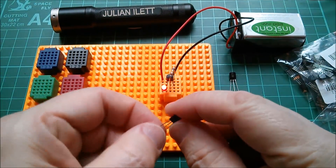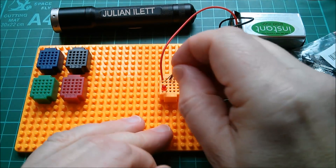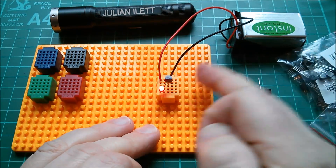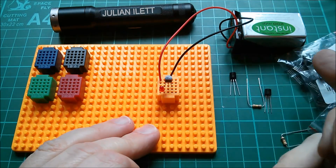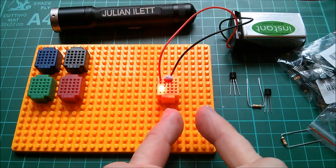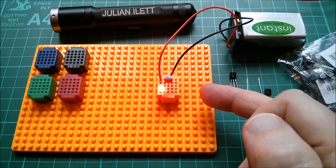Let's try the J112, which I haven't tried yet. Oh wow — now that has a lot of current flowing. I can deplete that away by putting a negative charge on that gate. Yes, that one does have more leakage, and it does seem to go a lot brighter than the other two. This one must have a much wider channel allowing more electron flow through that N-type silicon.